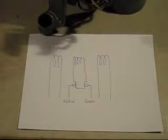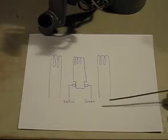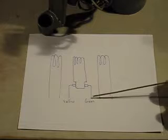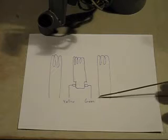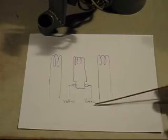To make life a little bit easier, I've made a schematic of a series connected motor showing why there are six connections. I've identified two already — the green and the yellow — they're the two brushes. Now what we need to identify are the two field coils, and each one has two connections.